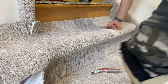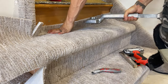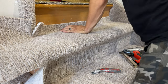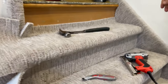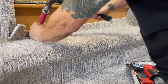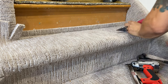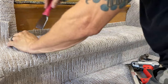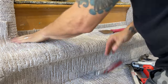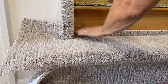I'm going to grab my trusty kicker and kick that a couple of times into the smooth edge — one, two, three, four, five, six — and lock that in. I'll take my hammer and my tucker and hammer that down on the 45. Then I'll rake those smooth edge pins to lock it into place, and hammer those pins down.